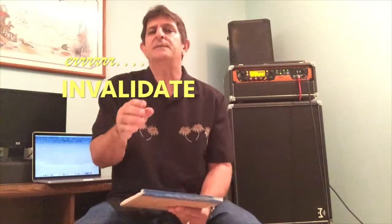Some people might have the thought — why not a standby switch? Well, from the way I understand the circuitry explained to me, a standby switch might not even solve the problem. If you have this unit, you might not want to fool around trying to put in your own standby switch — you'll just invalidate your warranty. Paul shared this: depending on the function of the standby circuit, it may not solve the problem. The pop is from the actual driver cones snapping into correct shape when the power is sent to them. So for the standby to actually work, it would have to send enough power to the drivers to maintain the shape even when turned off, which would probably draw a fair bit of electricity.